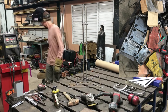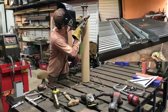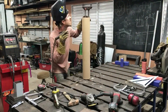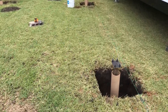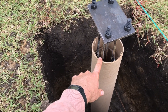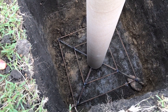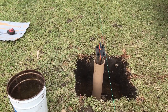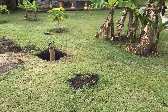One of the complicated parts is attaching the bolts to the rebar while still being able to pour the concrete. I ended up drilling holes in the plates, putting the bolts through, welding heavy bars to the back end, and then attaching those along with the ring to the rebar — it comes out really strong. I'm sticking with standard pier foundations like you find in big structures, just in miniature form. I used some cardboard about five inches across, centered and lifted up, then put about four inches of concrete in the bottom. It took about a day to weld all four for this 12-foot wide house.